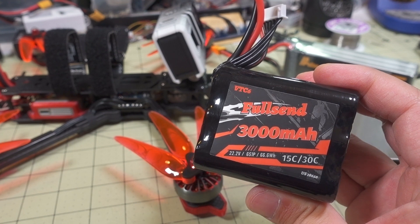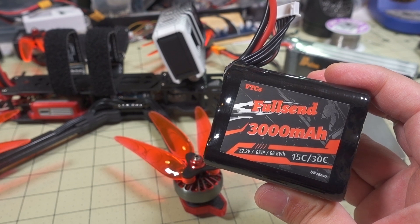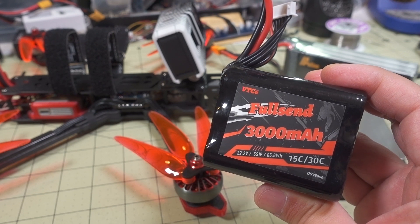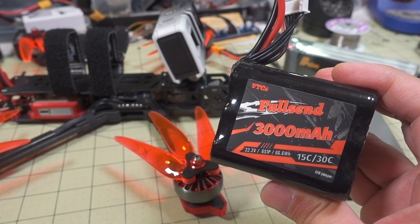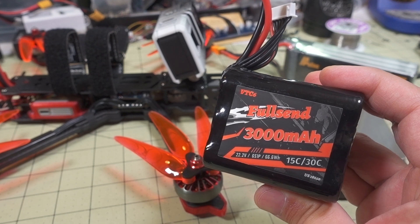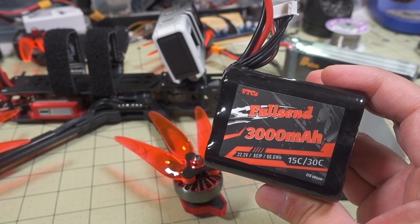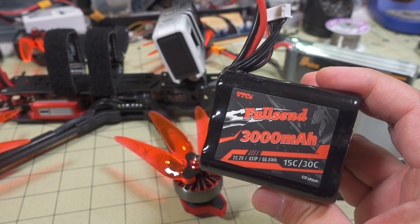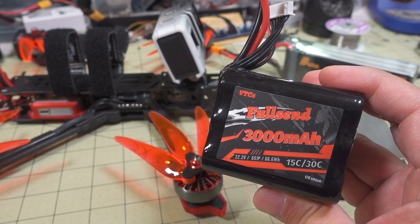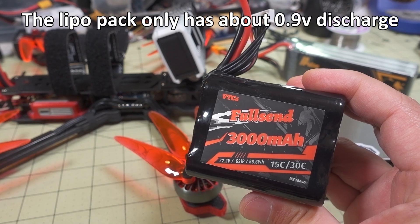From 4.2 volts down — it's going to give you some voltage sag. So while it's loaded, while it's actually in the air with a load on the battery pack towards the very end, you can get down to roughly 2.7 or 2.6 volts before things get sketchy, and at that point you're going to want to land. But the pack voltage will come back up after it's landed, and at resting voltage it's around 3 volts. So you get about 1.2 volts of actual usable flight range out of this pack, and I was getting about 25 minutes on this one.